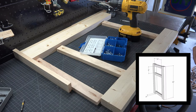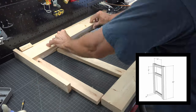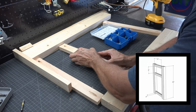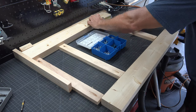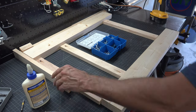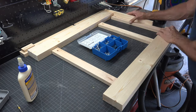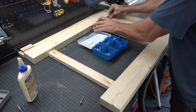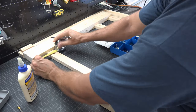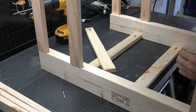Now we are going to attach our legs with our crossbars. Place all pieces on a flat surface and ensure everything is square. Drill in your crossbars to the legs. Before placing your crossbars in position, add a little wood glue to the end of each piece. The gap between the top and the middle crossbar will be five inches — this is correct in the instructions. When looking at my bottom crossbar, you will notice I am placing it at three inches from the bottom. Since you have already cut your legs to 26 inches, place your crossbar one inch up from the bottom.